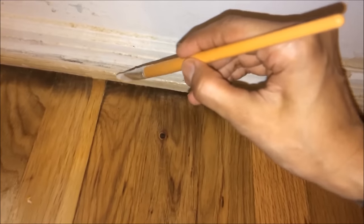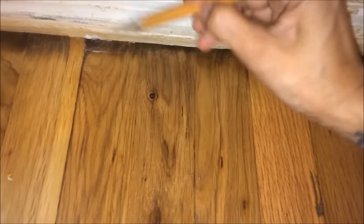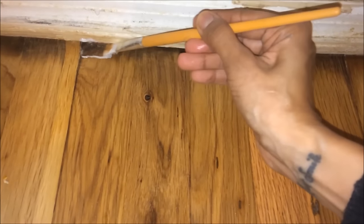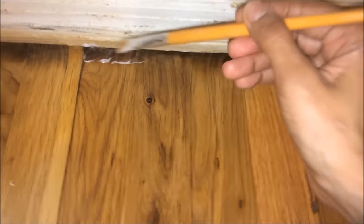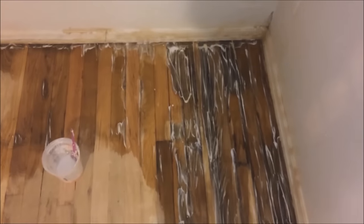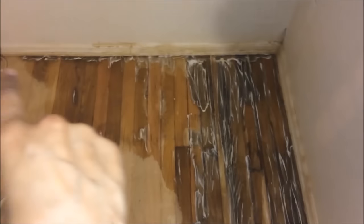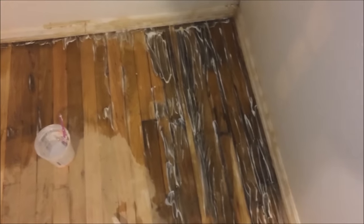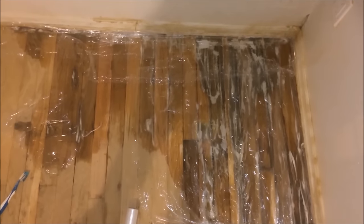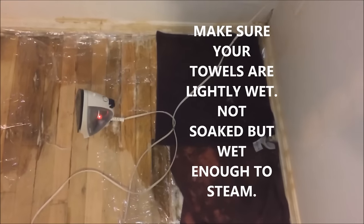This time I'm being careful with the application. I've got a little tiny paintbrush so I can make sure I get just the part that I want bleached. I don't want the wood bleached — I just want the stains bleached. Here we are with the developer all over it. You see, I just put it on the parts that are really black. Here it is with the Saran Wrap on top of it, and now I'm putting a towel on top.